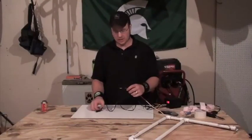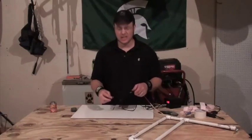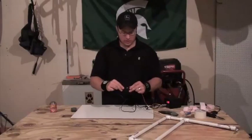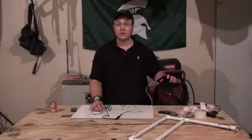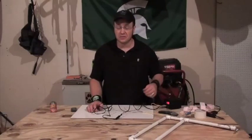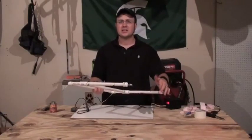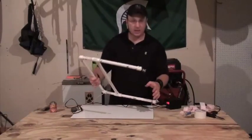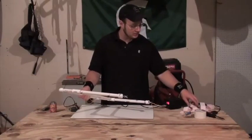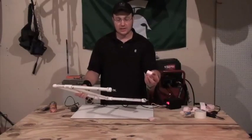I just got done soldering and applying brush-on electrical tape — I skipped that part because it's tedious and takes a while to dry. Next, hook this into your DC female connector from your power supply. I found that 10 volts works pretty well for this unit. We've got 11.7 volts now and it heats up pretty quick — within a couple of seconds of hitting the button we're already able to cut this foam.